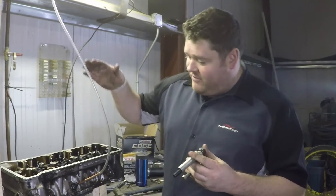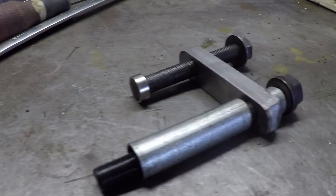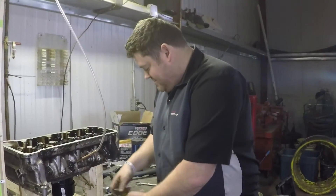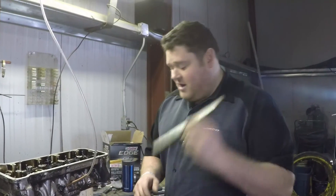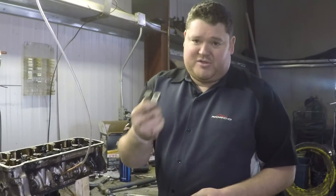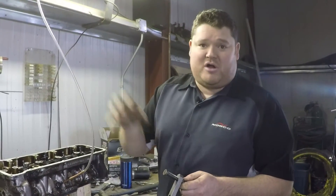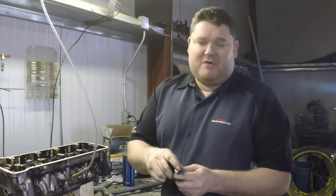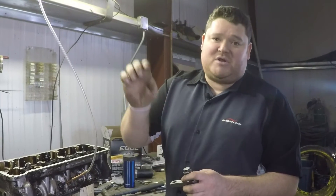The next step for this project — to reliably open and close the valves where we want to measure lift at different points of the camshaft lobe set — is to build a valve opener. It's a very simple system comprised of a couple pieces. The whole thing started as a chunk of thick rectangular stock that we cut down. Then we drilled and tapped a hole in one end for a bolt. I epoxied a magnet into the other end so it will hold the valve so we don't have to take springs on and off constantly. I machined down the other end so it's nice and flat so we can put a dial indicator on there to measure exactly how much lift we're putting into the valve.